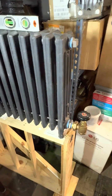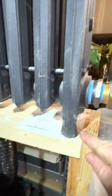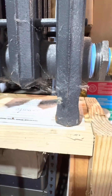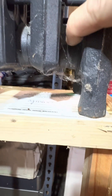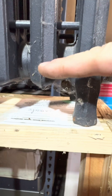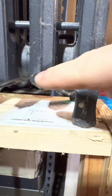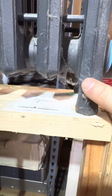The extra water is going to be mostly on this end — in the bottom of these pieces here. The interesting thing is, the way these are made, this passage between the sections is pretty thick. So the path for water to travel is in the middle of it here. There's a bottom part of each section that is lower than the passage between sections, and that traps and collects water. So there's a little water here, here, here, here, and here.